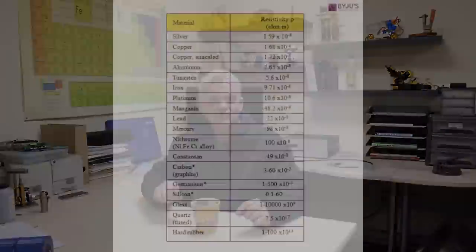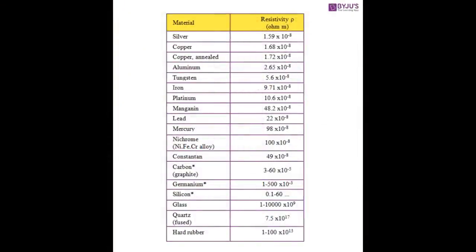You can see this: just attach a wire onto the two terminals of a battery and you will melt that wire. If I were to grab hold of the terminals of a 12-volt battery, well, it'll do nothing at all, because current can't flow as the resistance of my body is too high. A short, thick cable, the current can zip through and melt the cable. A thin, long cable has a high resistance. Remember, resistance is a property of geometry, meaning how long and how thick you make it will change the resistance. The thinner it is and the longer it is, the more resistance. The thicker it is and the shorter it is, the lower the resistance. This is true for every single material that there is.